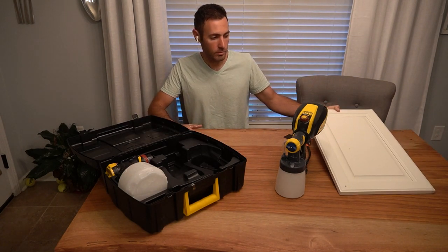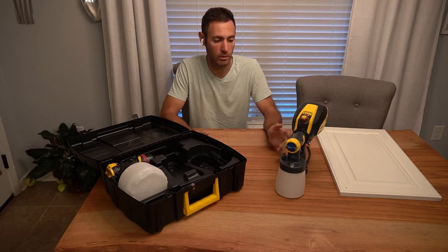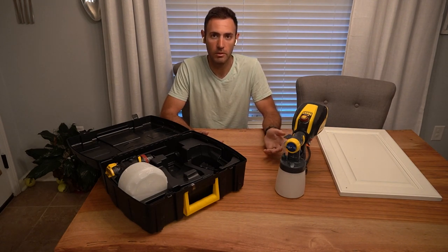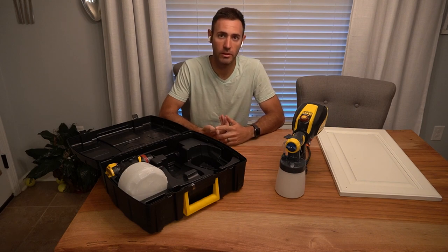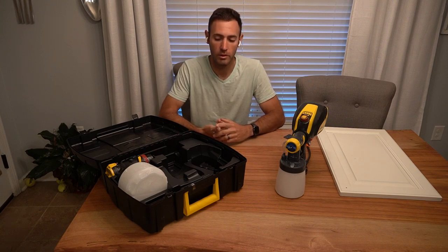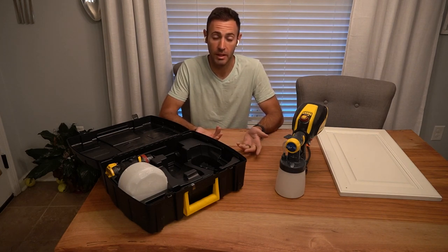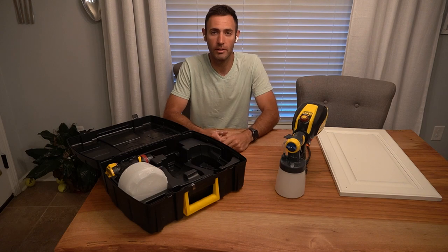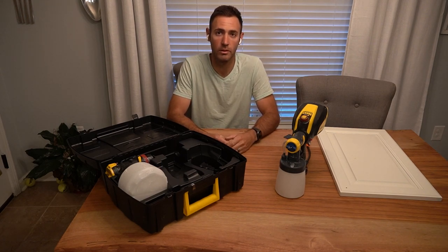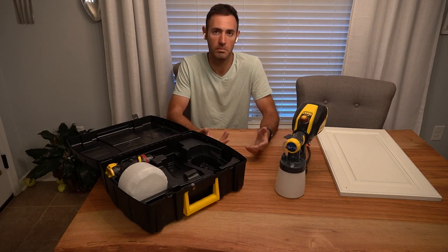Most importantly, you need to be able to use this correctly, and you need to be using a paint that works well. I recommend urethane trim enamel from Sherwin-Williams, the Emerald. I don't really like the Pro Classic very much. And you need to thin it. I thinned it by 15%. The can says not to thin it any more than that, and it says not to even thin it 15%. But even out of a good HVLP gun, like a really expensive one, you're still going to have to thin it some. So it largely depends on your process. But using this setup, I could get good results.